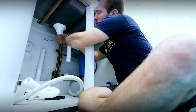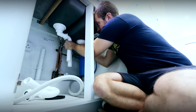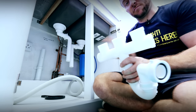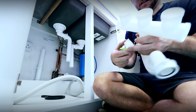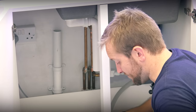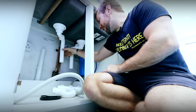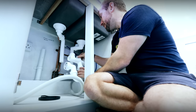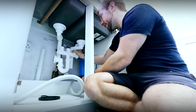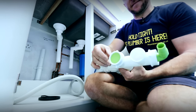The next thing I want to do is get these whipped in now. Make sure you put these on, otherwise you're going to get leaks and we don't want that. Pop this on there like so. Now we know that we've got our two down-pipes and they're going to be going into these three here. I'm also going to put on our overflow - make sure that the overflow hole has been cut out because sometimes they're not there. So we're going to push these back out of the way. We might push these down a little bit because we can cut these back as far as we like, so we're lining up our tops. I now know which ones I want to blank off - I can put my blank in there, done up - and then I'm going to do the same with this end one.